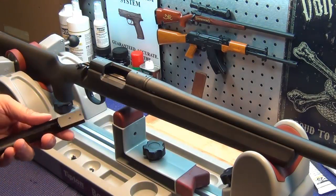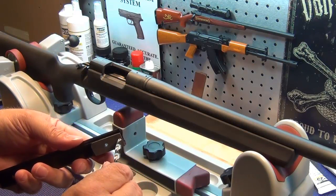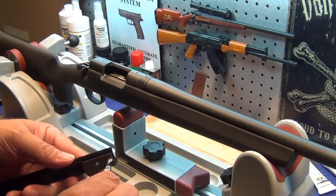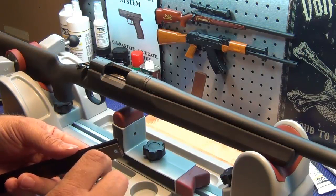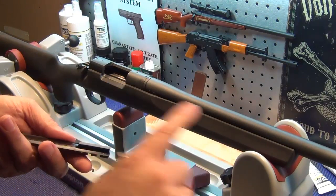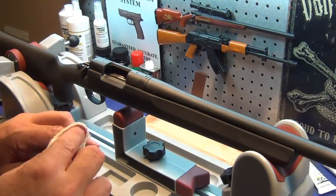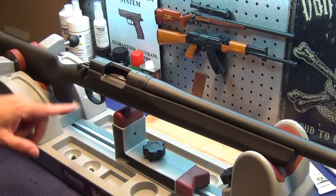Now what I'll do is I'll take a way oversized drill bit and right by these screw holes, chamfer just ever so slightly around them till it comes down to metal. We do the same thing with this one. Gives a small little chamfer around it. And you can take some time right now and clean up anything that's left on the base that you want to do.